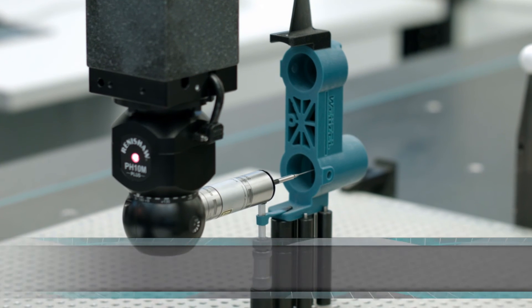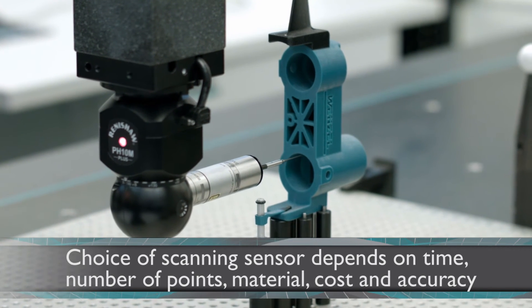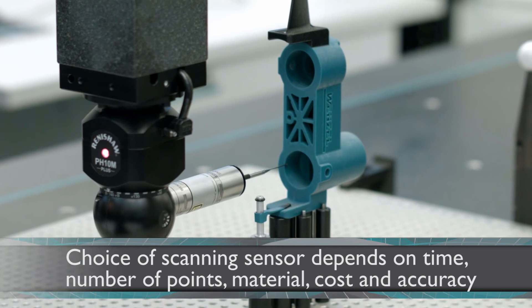As you can see, it takes a little bit of time and you have to touch the part. So maybe if you were scanning a material like beryllium where you can't physically touch it, then this type of technology would not be very useful. For non-contact scanning, it might acquire more points and move faster, but then you have this price differential.